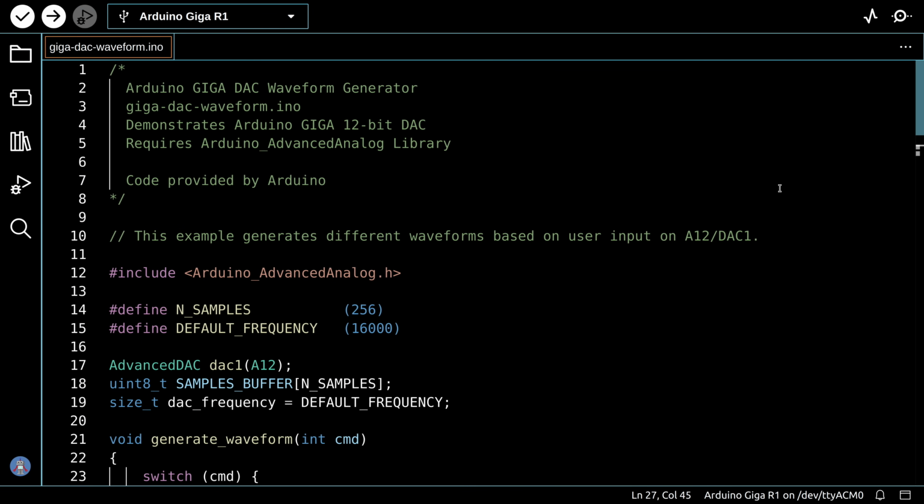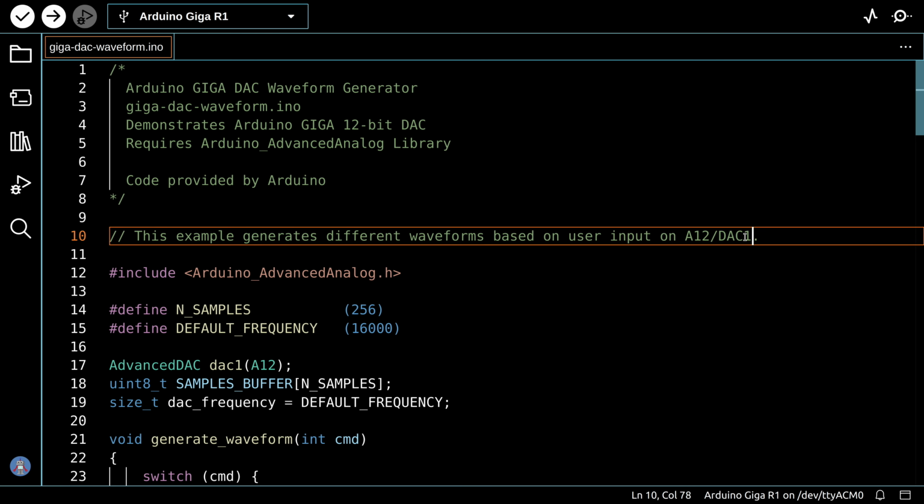Now the code that we're going to use has been provided by Arduino in their example codes, and the code itself is actually perfect. It only has one error in it, and the error is right over here in the description. It says on input on A12 or DAC1. Well, A12 is actually DAC0, not DAC1, but other than that, it's fine. So we're really going to DAC0, so everywhere where they reference DAC1, it's really DAC0.